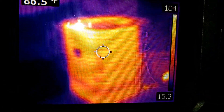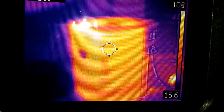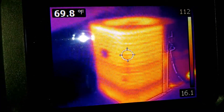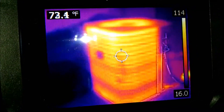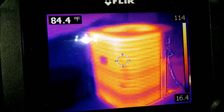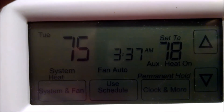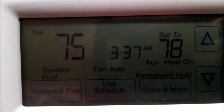All this unit is doing is basically running in air conditioning mode without the condenser fan running, thawing the frost out. It's actually sending a signal to an upstairs heater kit to supplement heat — what we call auxiliary mode. If you have a second stage of heat, more than likely it's a heat kit similar to this one. These elements on the right side of the kit glow a bright orange color, and your blower motor blows air across the heating elements, allowing hot air to go into your room while your unit is in defrost mode.